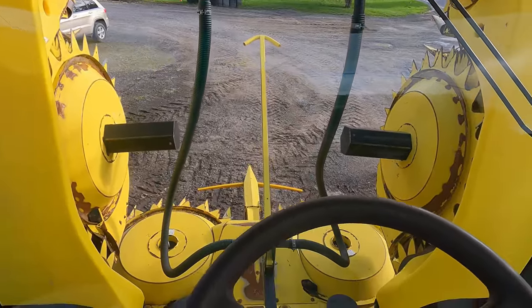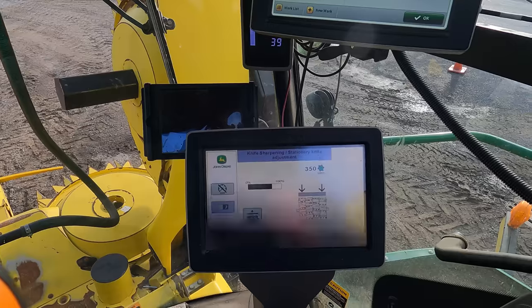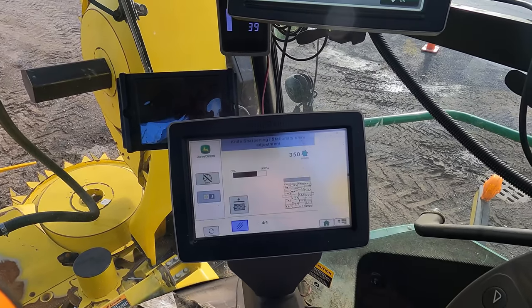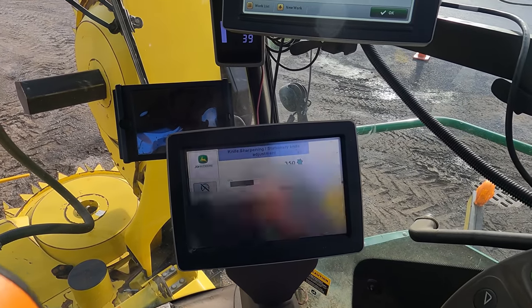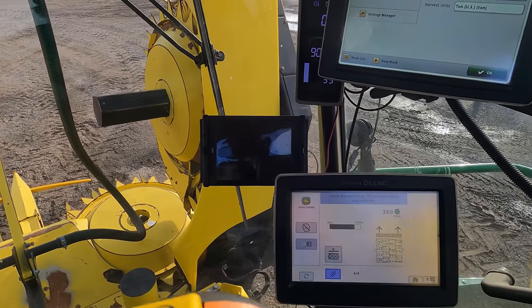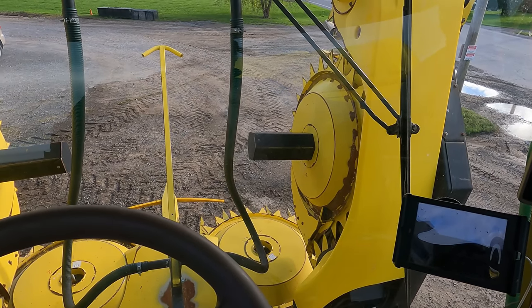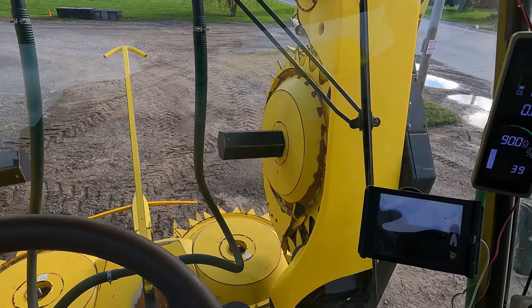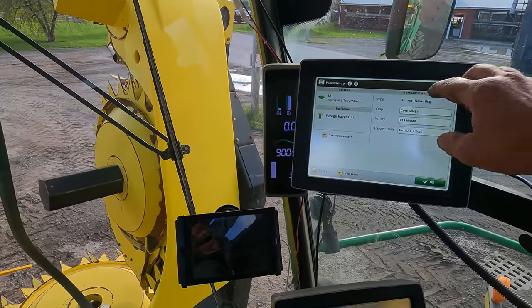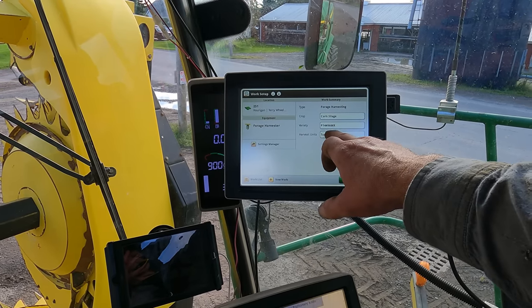Well, we are set and ready to go. We're adjusting the shear bar. We do not have corn knives in this, but I did go through and adjust all of the knives that were not in the spot that they were supposed to be in. We changed our display here, corn silage variety